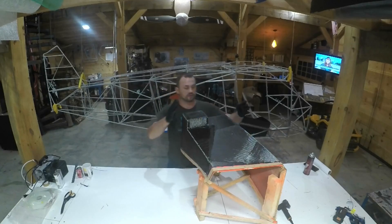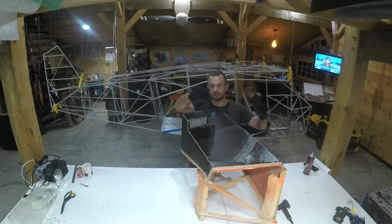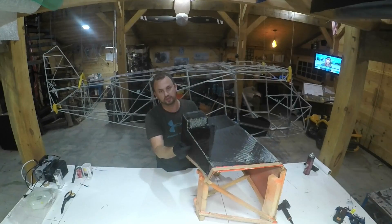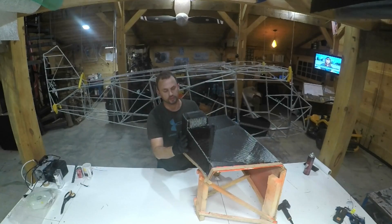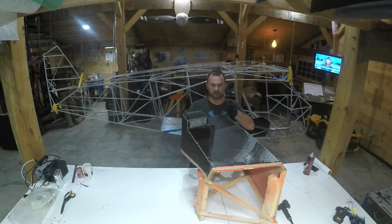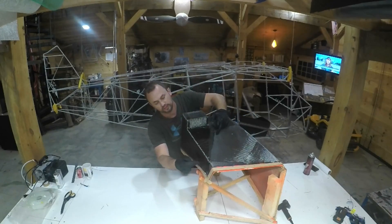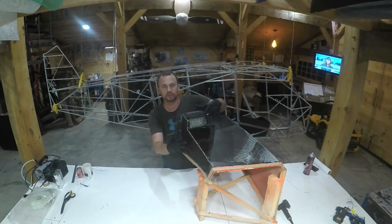What I've done is I've taken the three layers I did on that one, so that's all the same here. And then on this side I've kind of staggered the layers, and there's about seven layers here. I'm going to use this side to mount something, and then obviously this is going to be a stowage, so this whole area is reinforced. The metal tube for the airframe goes about right here, so I've got an anchor there. I'll have fasteners right there, and another one there, so this will be kind of stiffened up.